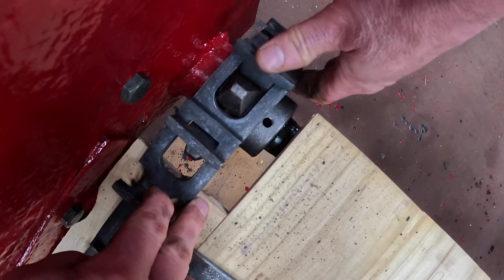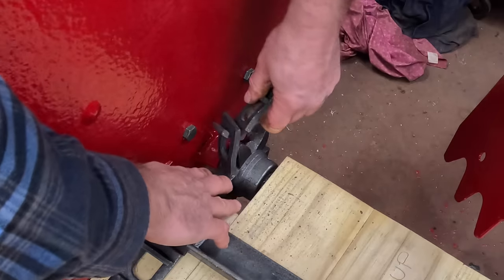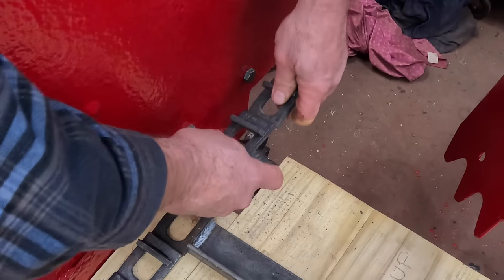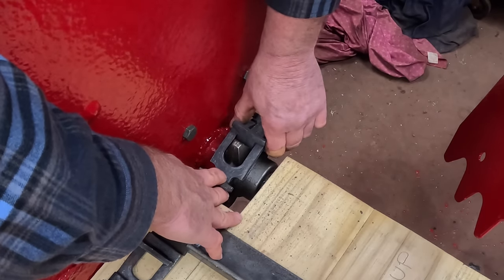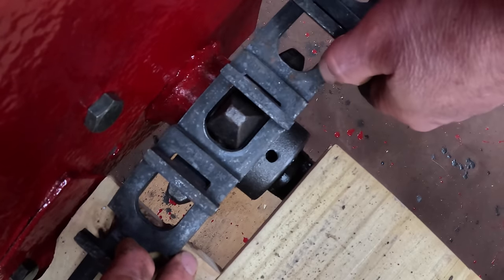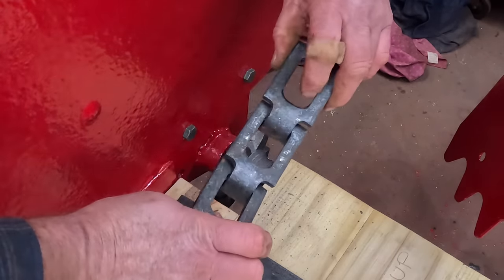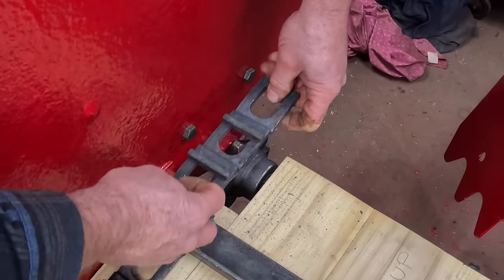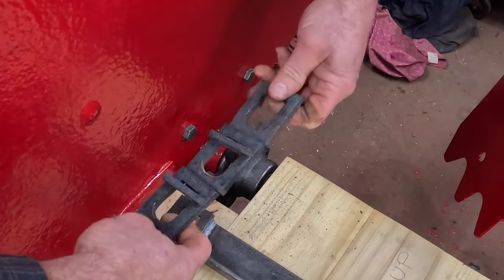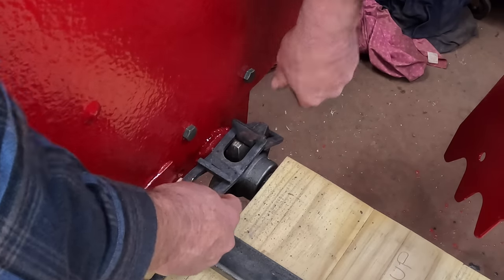Now, even though it's riding on this joining piece of the T, it's flat to flat, so it'll minimize sprocket wear. People will often say that you shouldn't have it bear on this link part of the chain, but in reality, I believe that it's actually stronger, because as the chain works through, it's wearing all along that surface as it bends. And remember, the thing you're really concerned about is sprocket wear, not chain wear, because each of these links only goes through the sprocket once each load, probably. But those sprocket teeth are going round and round many times during a load. So you want to really be concerned about how it engages the sprocket. And this one goes like this.